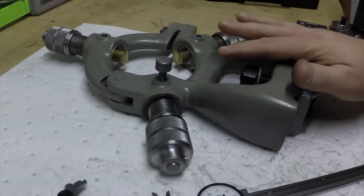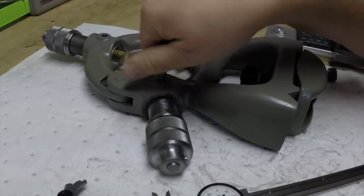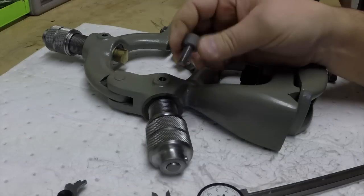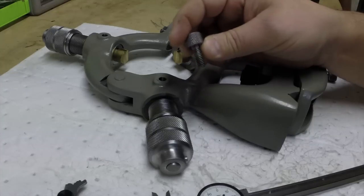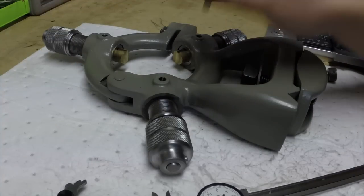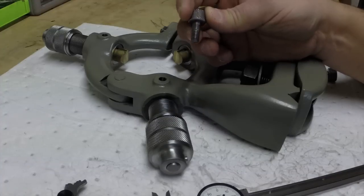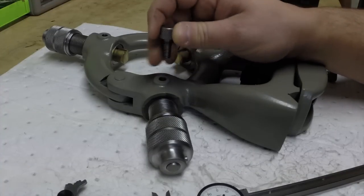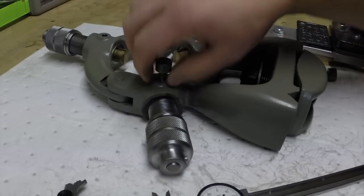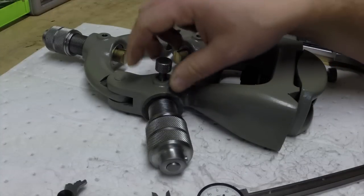The third piece is actually going to be three other screws, and this is for my steady rest. Again, this came with the steady rest, but I only have one, and I don't know if this is an original piece. It looks like an original piece, although I have the same exact telescoping follower rest, and the spec of the screw is identical except for the length of the threads. The one on the follower rest is a lot shallower, a little shorter, so it doesn't stick up so far like this. It's a lot closer to the thing. So we're going to duplicate that one. I took some measurements, and it's the same thing as this, only shorter.